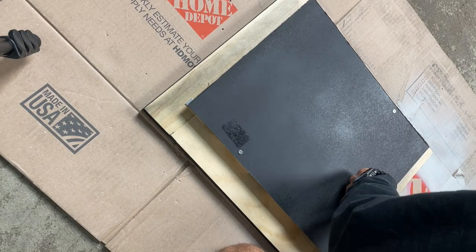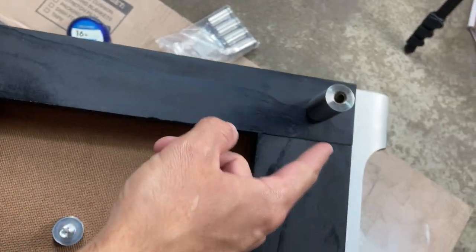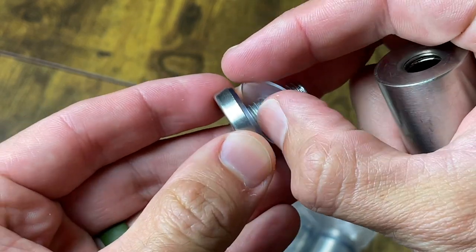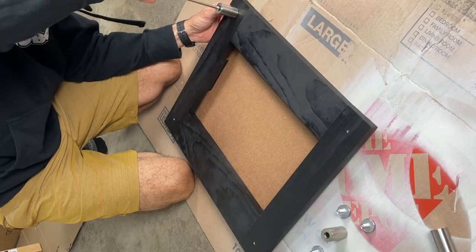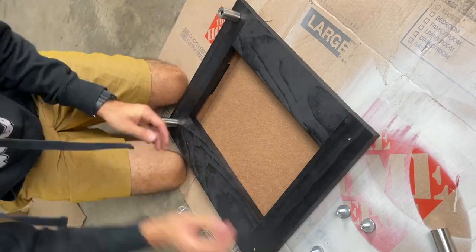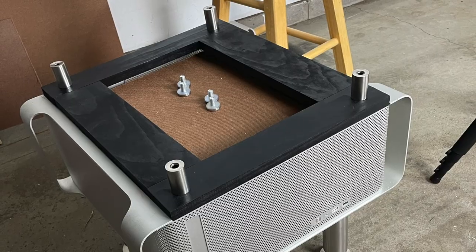The next day I started with screwing the backboard into the top frame — it looked pretty good. Then I had to mount my glass standoffs on top. These are from Amazon, under $20. They come with little silicone pieces that protect the glass. Mounting these was simple — just one screw right through the middle. The big thing was making sure all of them were the same distance from the edge. I can't stress enough that drilling pilot holes before screwing into wood is key — I have messed up a lot of wood by not doing that.